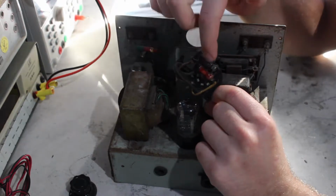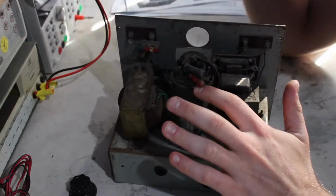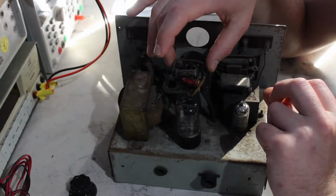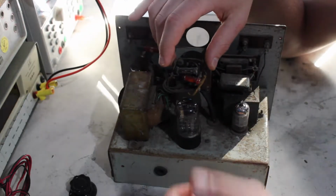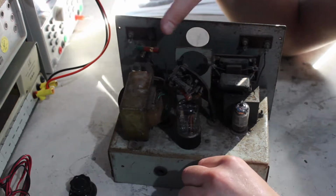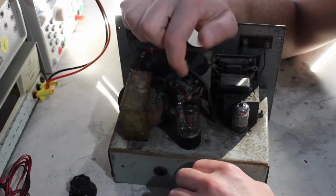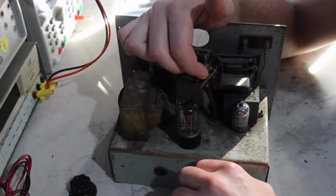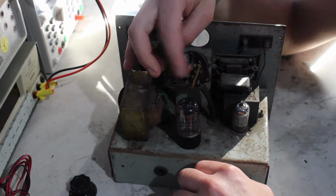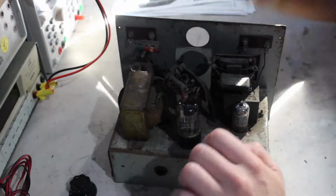It's just got these old dog bone style resistors, which I think are sort of 1930s-ish, I'd say. So obviously it's been built from junk, sort of junk box or old components that the builder had lying about, because this thing is from the late 1950s, and I mean, they had modern sort of plastic, or Bakelite, the carbon composition resistors, I don't know, they had those by that stage. So these things were certainly quite old at the time this thing was built, and they're kind of known to be problematic in that they go bad. But I've checked a fair few of these in this, and they seem alright. That's not one of the issues anyway.